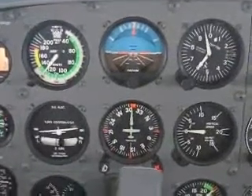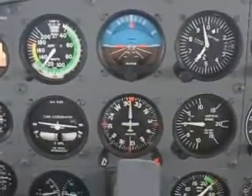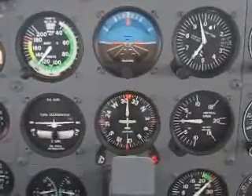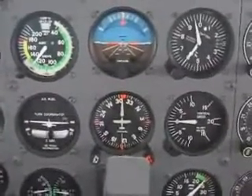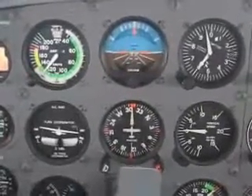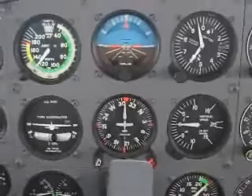You can see I'm touching the rudder pedals here to give a slight yaw left and right without changing the heading, so you can see how exaggerated the movement is of the turn coordinator as it starts to die. The first sign of death of the turn coordinator is that it gets very sensitive in its movement left and right.